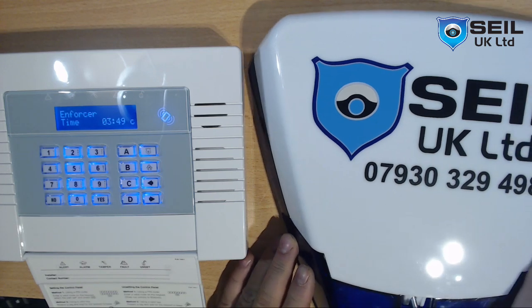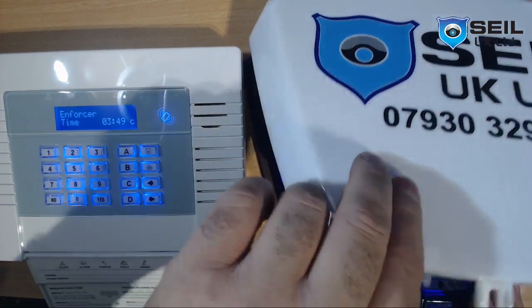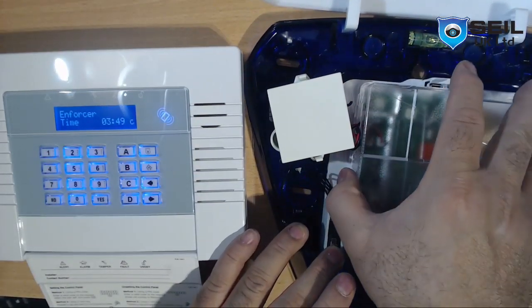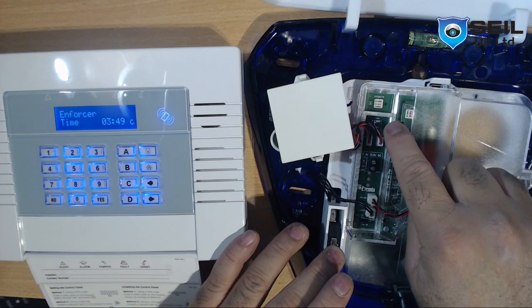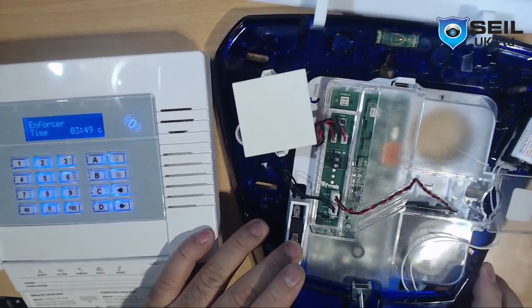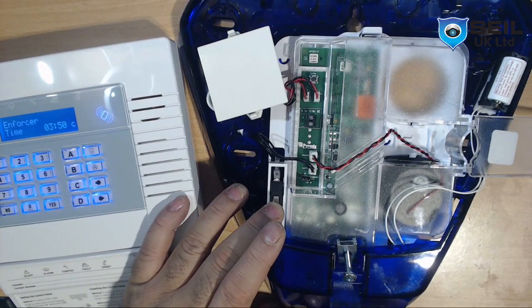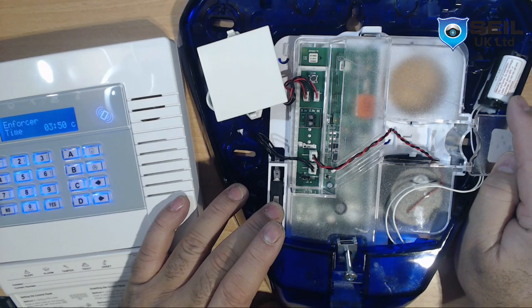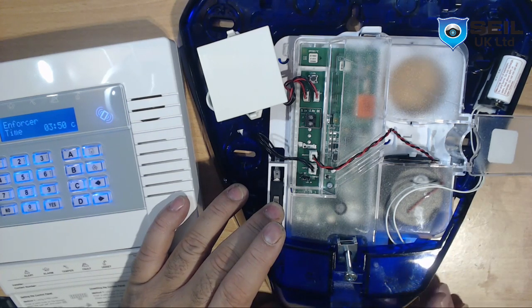As you can see, I have already put in my back box and my custom front bell plate with the battery inside. The battery is connected already here. I have already learnt the device, but I deleted it and I want to show you how to reprogram it again. These two cables are for the LEDs for flashing, because this is a wireless bell. At night time they make it look live. The 3-volt battery should give you about 3 years of battery life, and the bell flashes nicely at night time so you can see it is live.